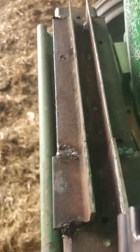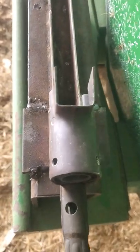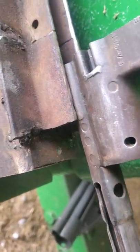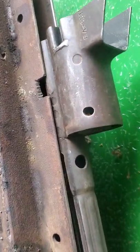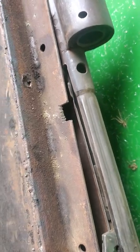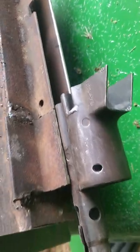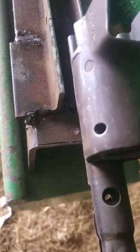I took my old receiver — the receiver ends right here on it. You're going to take that and just make sure it's a little bit too tight to fit in there. Because you don't want it too loose and it's going to flex back anyways. Make sure it goes all the way through, but that it doesn't just fall right in. You just weld those in place. Make sure everything's straight. Check your gap with this.